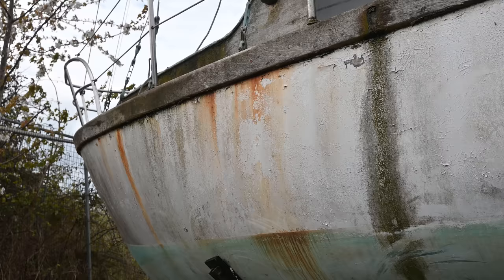So as we look around on the outside of the boat, you'll see how the paint is crazed just through age and it's flaking and whatnot. I'm hoping as it is sanded, it comes back to fairly smooth. I have an interface pad on my sander to make it soft and to go with the curves of the boat a little bit more. Hopefully I can just bring that back with a fairly softish grit. So anyway, hopefully I'll sand that down, look good.